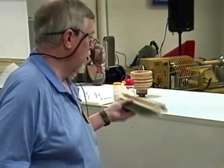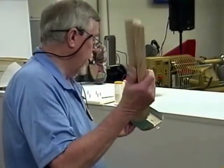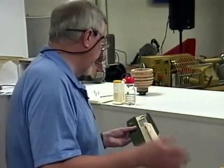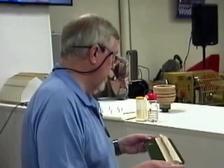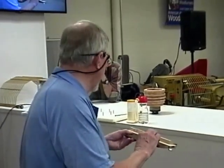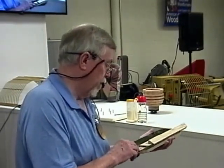This one, by the way, is for my SawStop cabinet saw, and so this is one that I use not only for the Wedgie Sled, but for a lot of other cutting that I do on the SawStop. These are replaceable maple inserts that I make just out of 1/4-inch maple, and that way I can always have a zero clearance insert for my blade on my table saw. I've made these for a SawStop. I made one for my Jet that didn't work because the insert plate for the Jet is only 1/8 inch thick, and you don't get enough material. It's not solid enough.